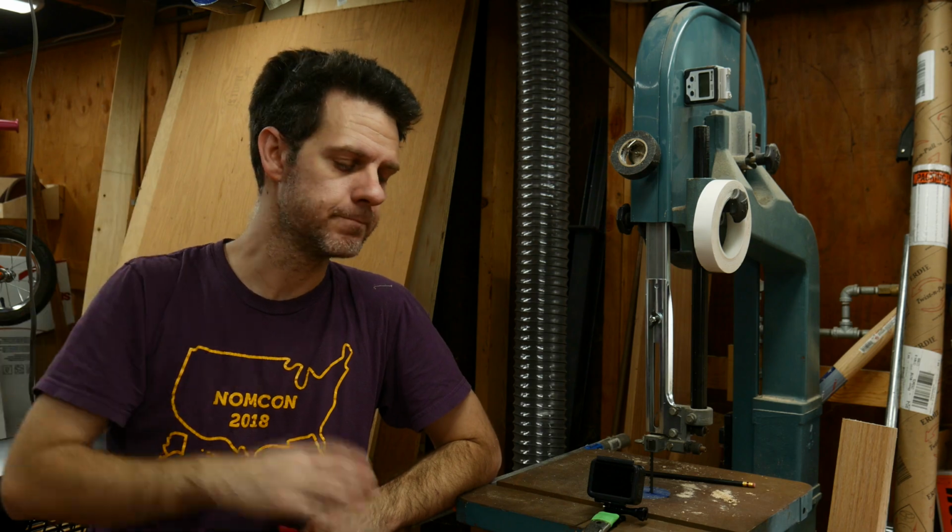The bandsaw started cutting sort of at uneven speeds, and I attribute this to one of the belts that has a little bit of a curl permanently in it from where it sat for a couple of years before I bought it. And I've got a piece of the linkable belt that I think is long enough to replace it, so I think today is just going to be a little fix-it day. We'll start with that, and then I'll try to figure out why the drill press is making such a racket when you put the quill up.